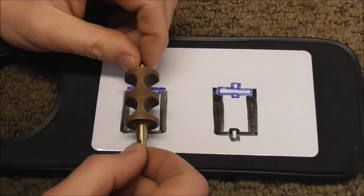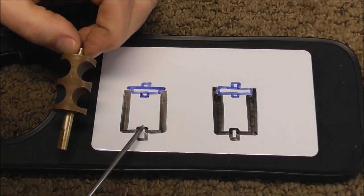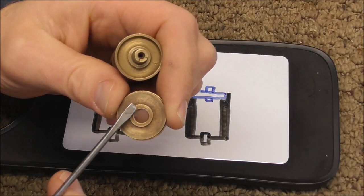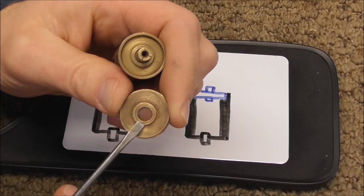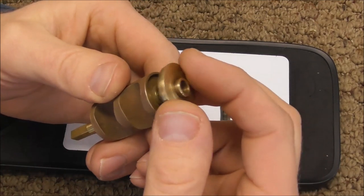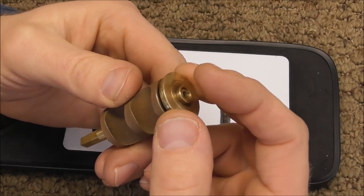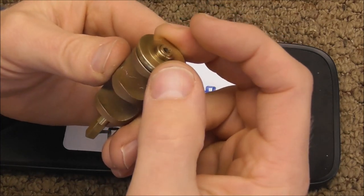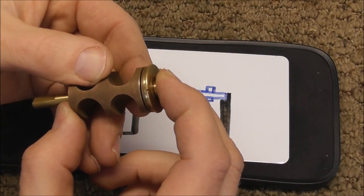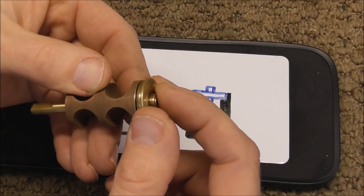The valve goes inside the casing, and when it moves up and down that means the gap between the bearing plate and the rotor is too large. You can see where the bearing plate makes contact with the rotor — right in the middle. When there's too much gap, the valve moves up and down inside the casing, so you need to lower the bearing plate down onto the valve. You do not want to go too far because the rotor will get squished inside the casing, but you want it right down on top of the bearing.